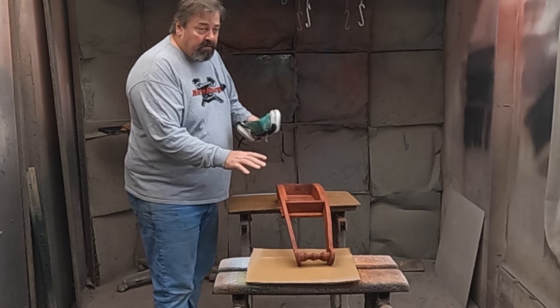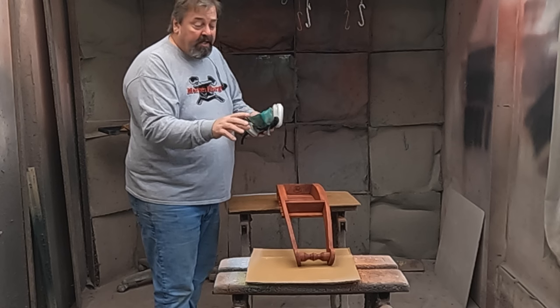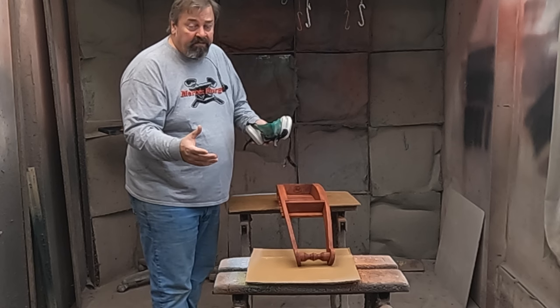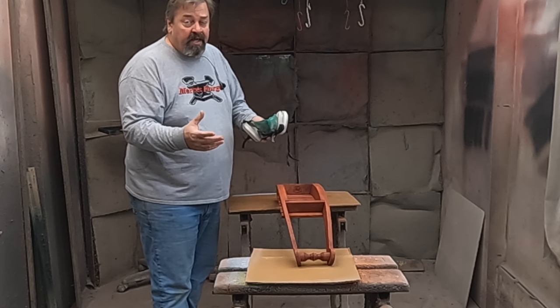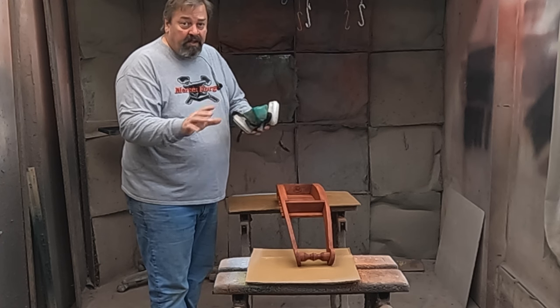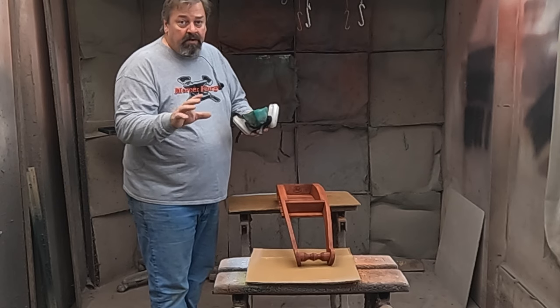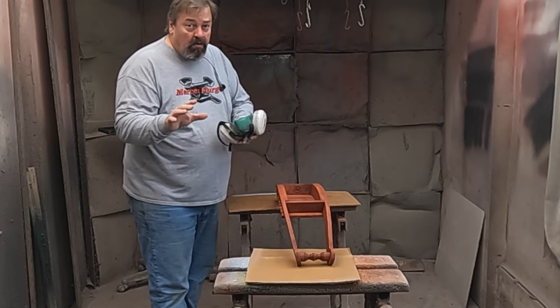The reason I like to start with the rockers, I've got the gun all set up with our pre-catalyzed finish in there. It's a waterborne finish. I use Sherwin Williams Kem-Aqua Plus. Again, in the description, there's all of the links and everything that I use, everything from sandpapers to my carving tools. It's all in that description.